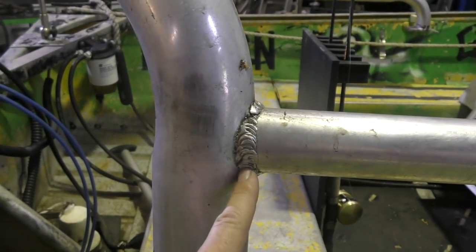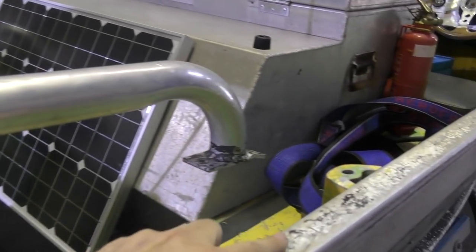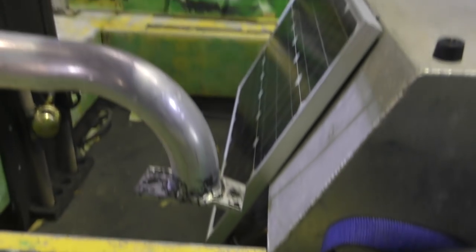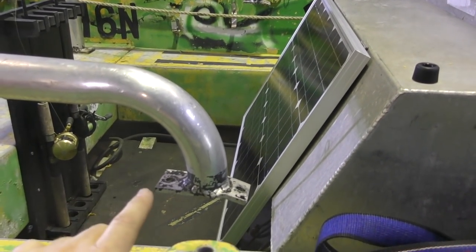What I am going to do is cut these bars off and change the angle this way, because one of these bolt holes can go through the rollick on the gunnel. The nice thing about that is it'll actually brace the two sides of the boat together as well, so I think it'll cut out a bit of flex.